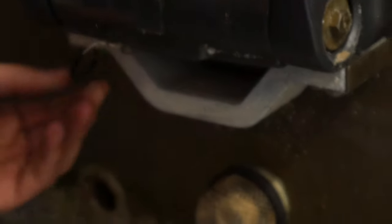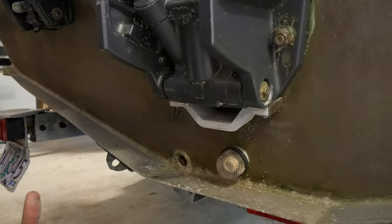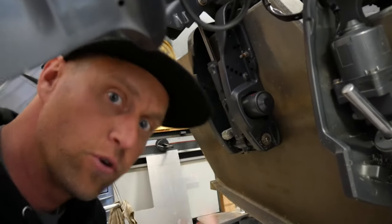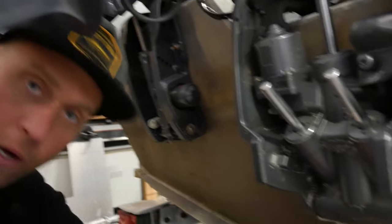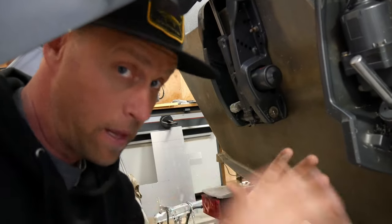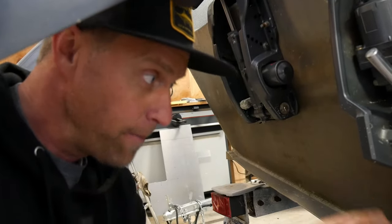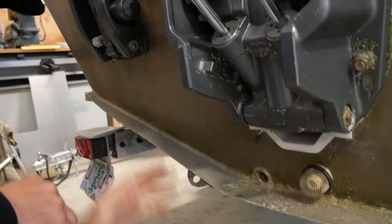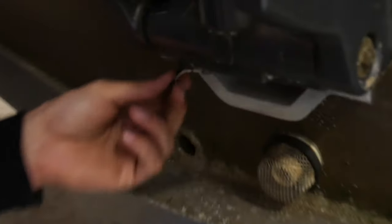Here's something important to know. This wire goes from here to the anode, and there's another one on the lower unit. This wire goes to those sections to bring the electrical ground down to your anodes. If these didn't have a solid ground to the boat — if it's a fiberglass boat and it didn't get its way back to the ground on the battery — then these anodes wouldn't activate and the corrosion would attack the metals you're trying to protect. That's what those straps are for, and they're very important for corrosion resistance.